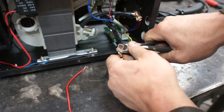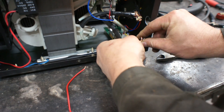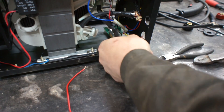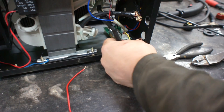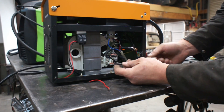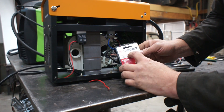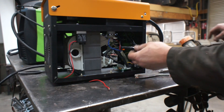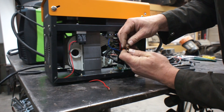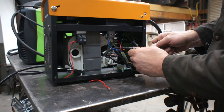I'm going to pre-bend these to 90 degrees. Now if you want to get fancy, you could definitely solder that connection. This fits right in and I don't even have to modify the hole. I've just got a short little jumper wire here, and I've already added a split bolt here on my MIG lead. These are made for wire splicing — I picked those up at my local home supply. They're a copper split bolt with a nut that goes on top, and it just clamps your two large gauge wires together — perfect for a situation like this.